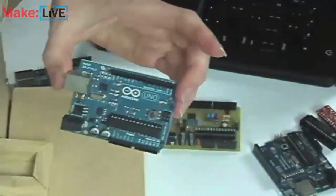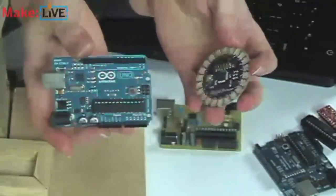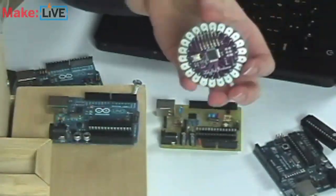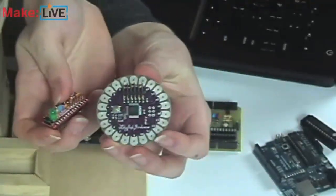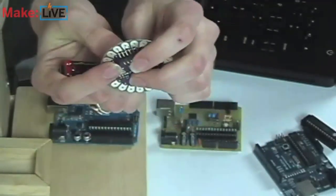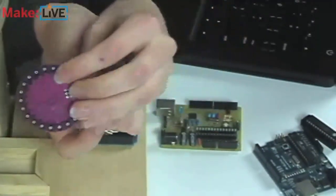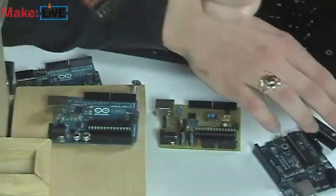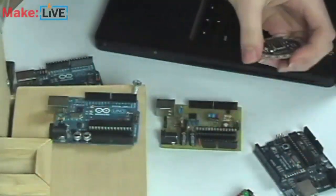That one is the Arduino Uno, released just this past summer at Maker Faire New York. There are plenty of different kinds of Arduinos - it's an open source platform, so anyone can make any version they want for different applications, maybe a smaller version or just change one little thing. For instance, this is the LilyPad Arduino, designed to be sewn to a garment or used in wearable applications. It's got big conductive pads designed to be sewn with conductive thread, and it's really thin with no pointy bits on the back. And then this one is a tiny Arduino - like a little caterpillar. The Atmel chip sits underneath it on your circuit, so it has a very small footprint if you're looking for a teeny tiny one to embed in a project. Here's one that I made myself.